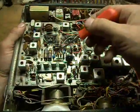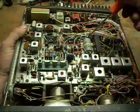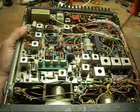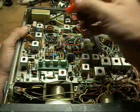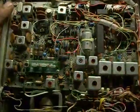It started producing putrid smoke all over the place. Got that one disconnected and it's still got problems because the capacitors the manufacturer used are pretty much all tantalum capacitors throughout, so to get this one working again probably all those capacitors are going to have to be changed.